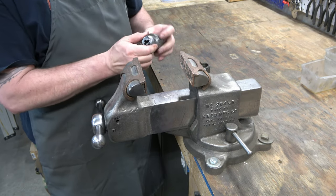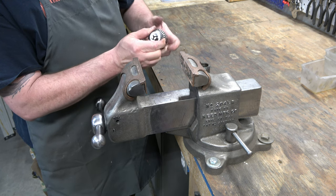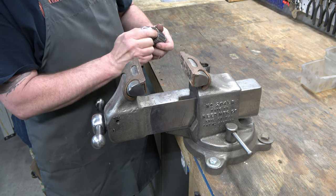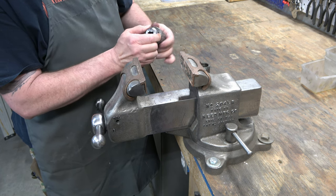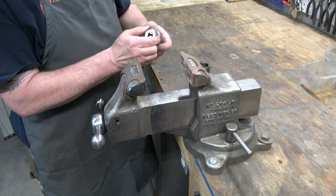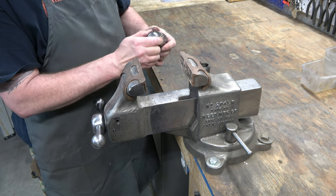We're going to take this over to the vise. You want to retract the jaws so they protrude about a half inch outside the chuck, then use an old sleeve from another chuck to compress this sleeve onto the body. You can see that lip on the back end of the chuck body — that is a seated sleeve. Now we should be able to rotate the sleeve and the chuck should operate as it's supposed to. Check out the Jacobs Chuck Omnibus video for everything you need to know.